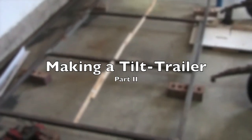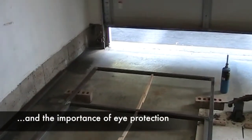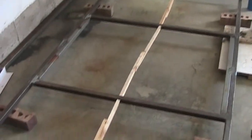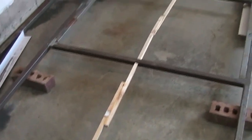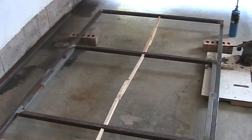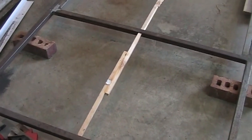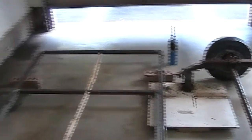Got some more welding done. I noticed when the thing is all welded up the outside bars kind of bow towards the inside. Not having an 8-foot 2x4 that I want to sacrifice to the job, I just cut up some scraps to stick in the middle here and make sure that the outside measurement is exactly the same as the inside — to keep it square.